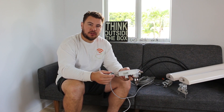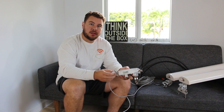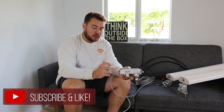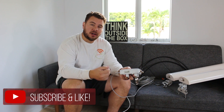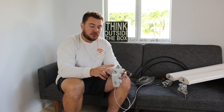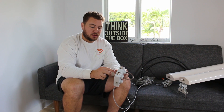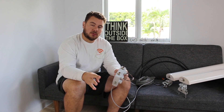Once you reach your access point outside, there's a little cap that comes off — this is what makes the access point watertight. There's a black grommet in there that you can cut in half to wrap around the cable and get a watertight seal. Once you get that done and plugged in, you're going to have two N-female connections on the top. We include in our base station kit three-foot coax cable connections that connect from your access point to your sectorial antennas.